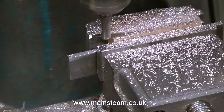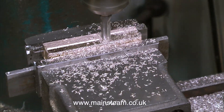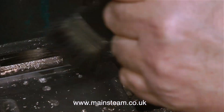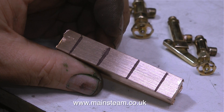I need to make it square, so first of all I cut one surface, then I turn that over and cut the other surface. After a while, by rotating the piece of work in the machine vise, it eventually becomes a square piece of gun metal. The square piece of gun metal is on the bench and I've marked it out to drill the holes to take the valves.